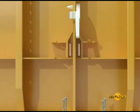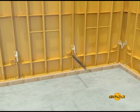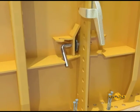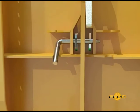Step five: place required reinforcing steel. Step six: determine the spreader tie slot that will be used, insert the tie and pin with the EFCO standard pin, locking the handle of the pin. It is important to note that spreader ties are only required on one side of an EFCO flange joint.